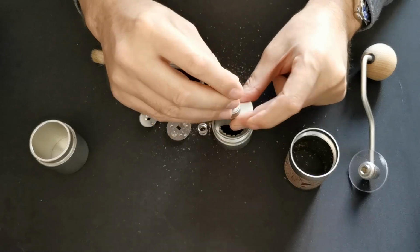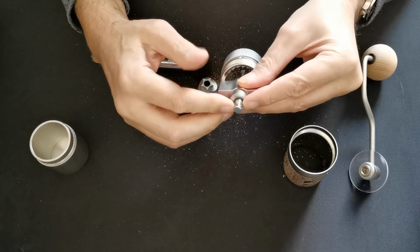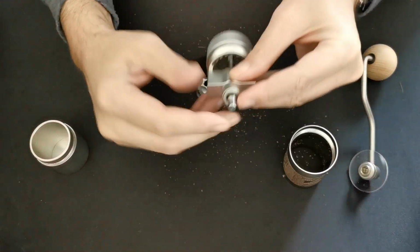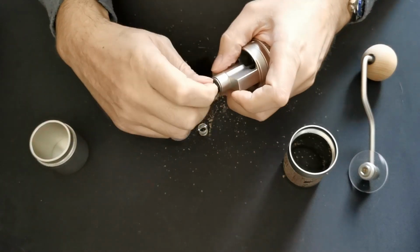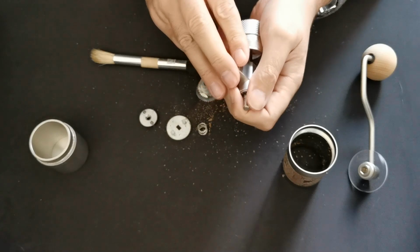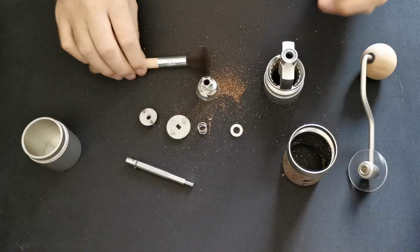Like I say, it's a fairly stiff push. You don't need to really lubricate that shaft. You can lubricate the shaft if you wanted it to go in and out easily, but you don't need to, because you're thinking, oh, it's hard to get. It's not spinning freely. That spinning is held by the bearing. The lubrication might just make it easier to pull the shaft in and out. Okay, so that's your shaft, that's the whole grinder.